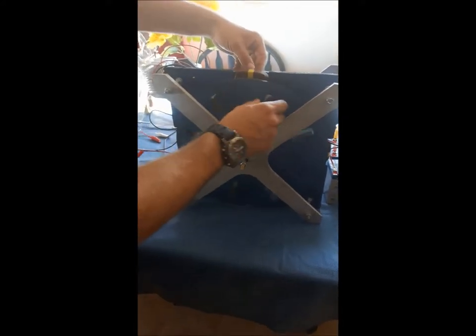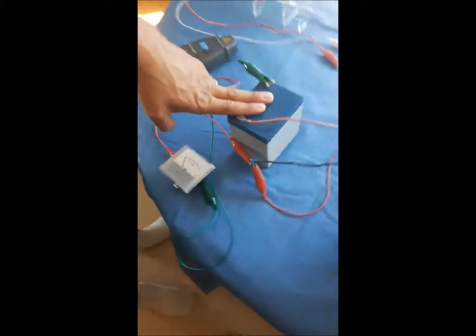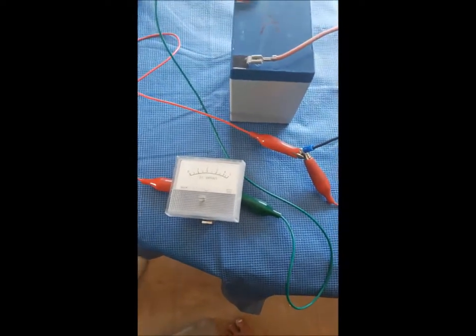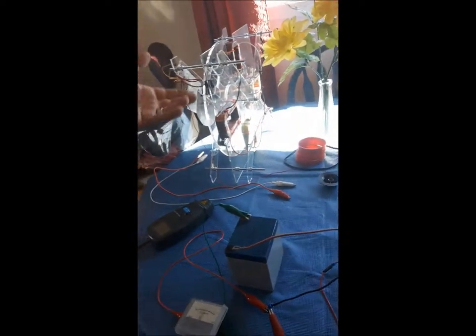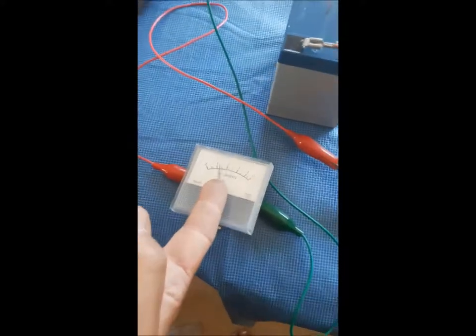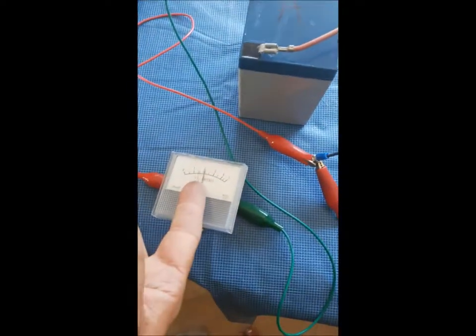There are just a bunch of ceramic hardware store magnets again — four coils just like the other motor. I've disconnected the solar panel and connected this up to a 12-volt battery, so we're running the motor off of that. 36 volts on the charging end — let's get it started. Just watch the ammeter as I start it up — you're going to see it peg the meter. It pulls a lot of amps. My point in this video is just to show that this motor takes a lot more energy than the other one. The higher-density coils with more windings make it more efficient — less input power to get the same RPMs. The average amps are leveling out around 2 amps. So 12 volts at about 2 amps — that's about 24 watts.